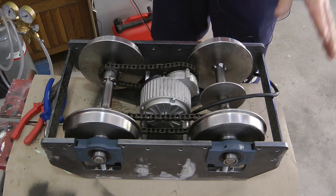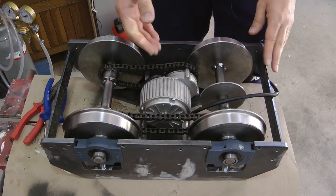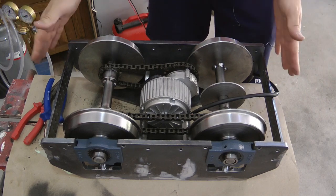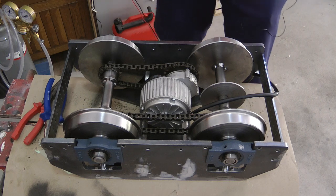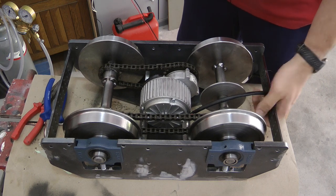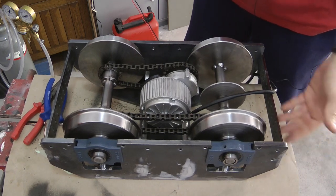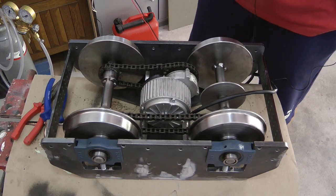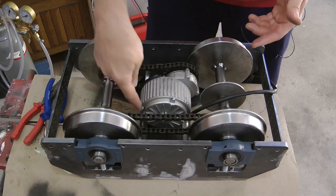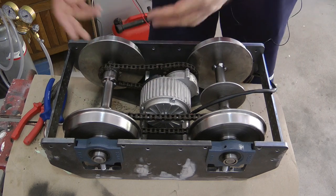The brakes are something I'll probably do separately. The reason I wanted to get this far is because I want to get on with painting. Now everything is welded on, so I can disassemble the bogeys and both of them can go to the paint shop. By the way, this is really heavy — I'm guessing something like 20 or 25 kilos. I'm not really surprised — this is 10 millimeter gauge steel, the main plate is also 10 mil, and only a few pieces are 5 mil. Then you have the motors, axles, wheels, and everything, so it all adds up.